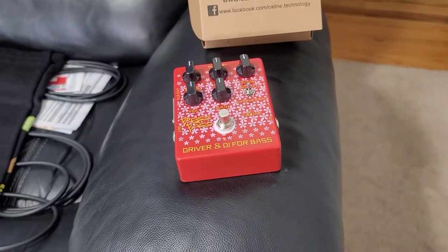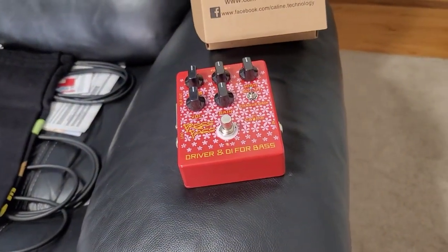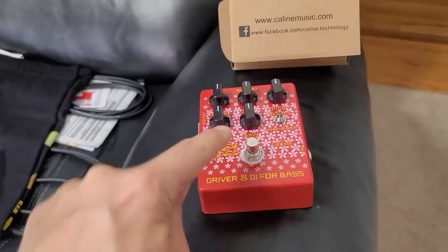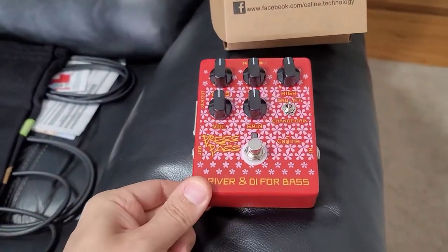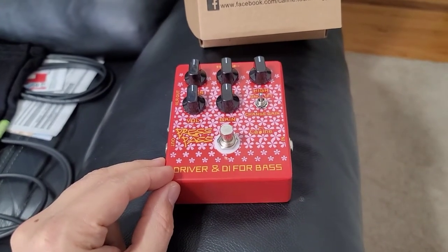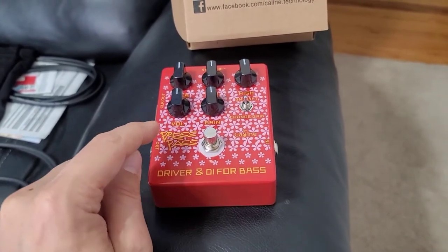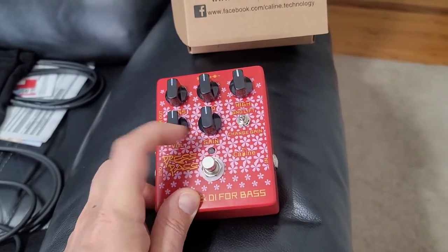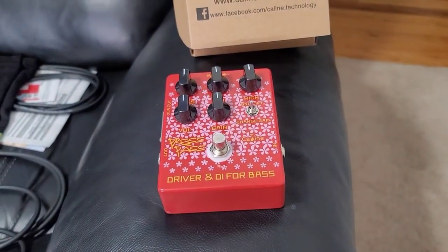On the topic of circuit design, I have a treat — I have the schematics. I'm not going to show them in full detail out of respect for the engineer in Japan and also K-Line, but I will be zeroing in on the function of this switch. As mentioned with the Wine Cellar, this is not a true bypass pedal in the traditional definition. The input and output on the quarter inch is a buffered circuit, meaning it does require power to pass the unaltered signal even if the pedal is not engaged. That's how the architecture of this pedal is set up.